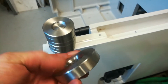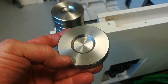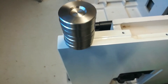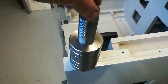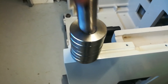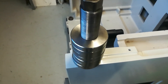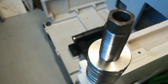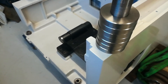Just one other thing - I'll show you the feet I've made for the machine base to sit on. I've made these out of off-cuts - they're actually 316 stainless, probably a bit overkill, but I had the material so I thought I'd just make them out of that. The adjustment screws just sit in there to set your height for your feet. I've pasted them with anti-seize so they can spin freely. We've got a stack of them there, all ready to go back on.